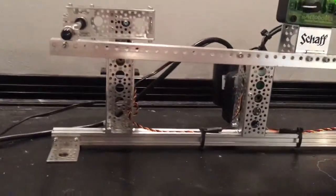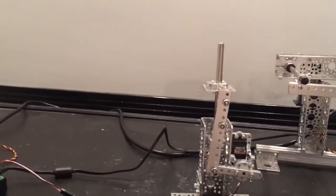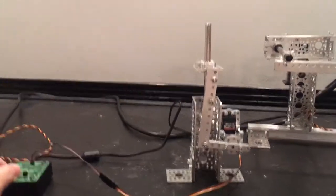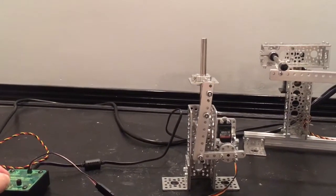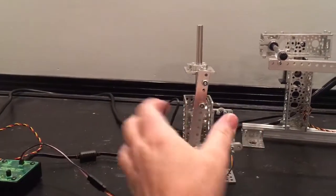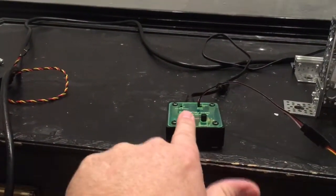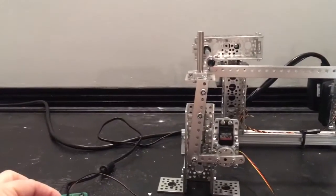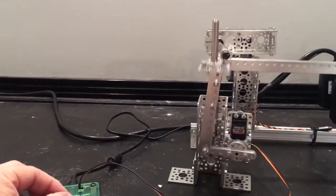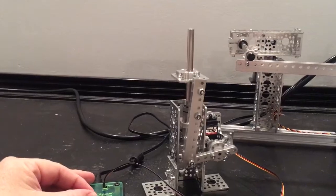I actually came up with another string height gauge, this one right here. And you'll notice that this one is actually automatic. So you just put it in your piano and gently raise it up until it touches your first string. Then you move it over to the other string, and using this little controller right here, you have a left side and you have a right side. So you would move this little cable over to the right side and then adjust this pot accordingly, to wherever you want it to go. So on that second string, move that up wherever you want it to go.